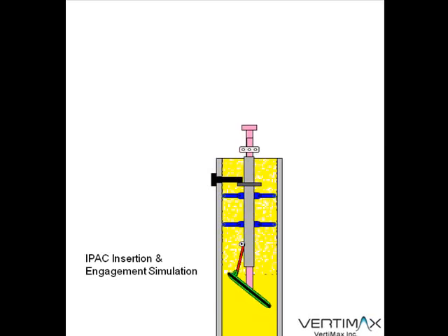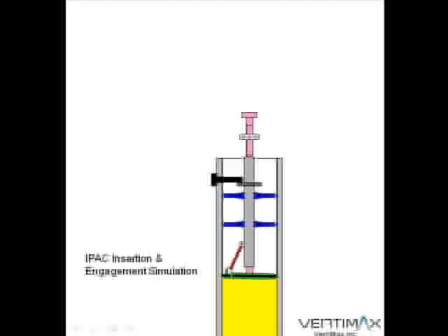When that happens, the valve will be closed by the force of the oil pressure acting on it. The red strut in this area will provide torque as this valve is pushed backwards and the center plunger, which it pivots on, moves backwards. This strut will apply closing torque to the valve to shut it.